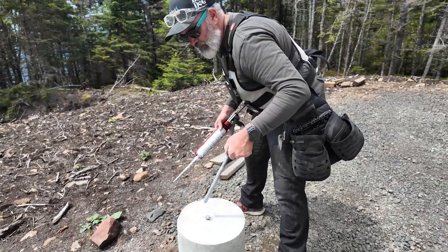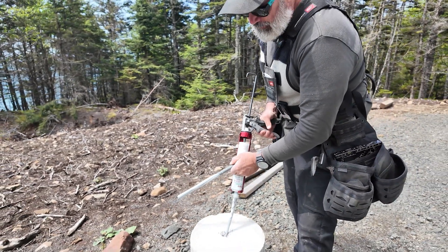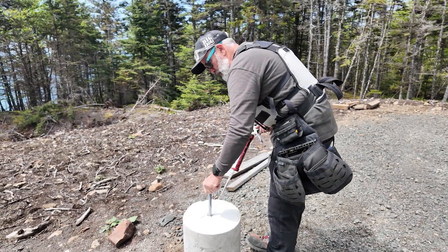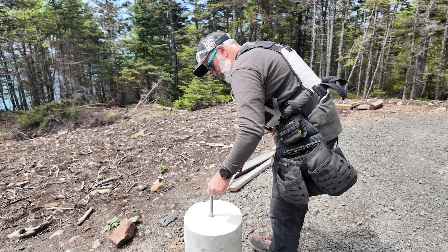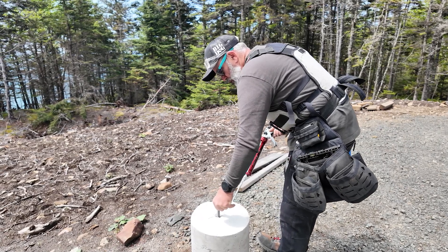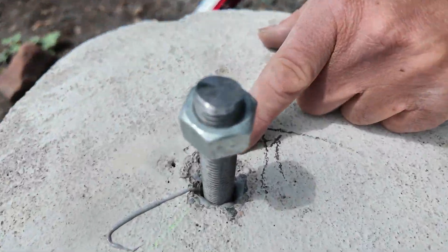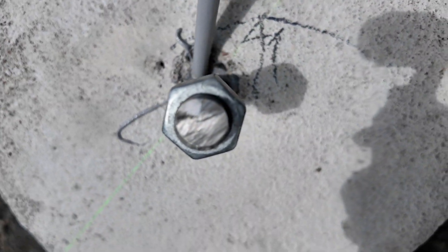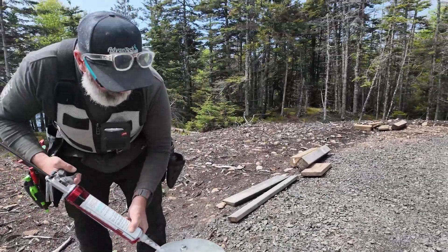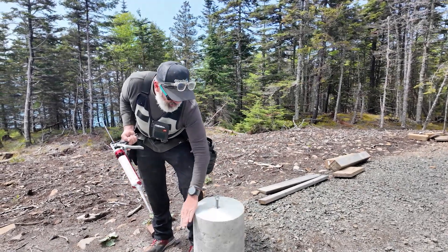I'm pulling this back out so you can see. That's the type of coating you want. Now that I've pulled that back out, I'm going to add a little bit more, just in case we lost any. We might have another little air pop here. You can see the epoxy is coming up in this side of the hole. I'll add just a little bit more on top. The reason for that is, if any water gets there, I don't want it to infiltrate down along there — I want it to shed out across the top of the concrete pier.